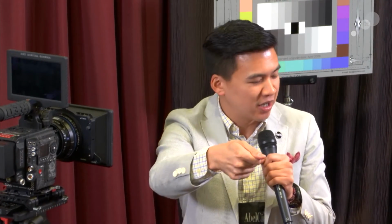Right? And there's all these various OLPFs available, from specialty use like the infrared or the underwater shooting versions to the more standard versions, like the appropriately named standard OLPF. Or you have your skin tone highlight or the low light optimized versions as well. Also third-party options as well. Kippertie has made a bunch of what I would call beauty OLPFs and neat effect low-pass filters that are available as well. And now it's a much simpler single Torx. You loosen the Torx, the whole OLPF drops out, you put a new one in and tighten it again, and it makes it really easy to do swaps.